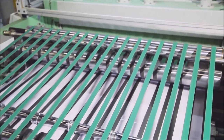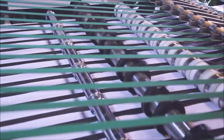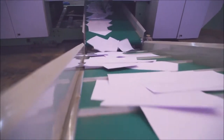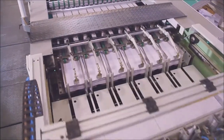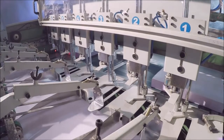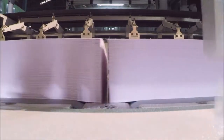After accurately slitting and sheeting the paper from the reel, it passes through the conveyor unit which is provided with an overlapping system to control the speed of the paper. The conveyor unit is also provided with a rejection gate to remove rejected paper and put it onto a conveyor at the bottom of the machine. The 6-pocket collecting unit is provided with a vibrating system and backside jogging for smooth stacking of paper into the pockets up to a maximum of 500 sheets, with automatic counting of cut sheets.